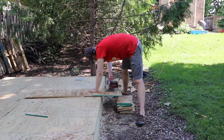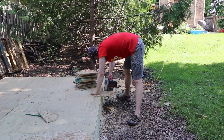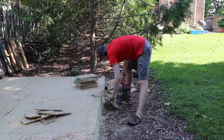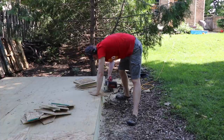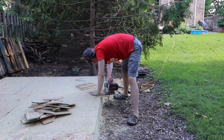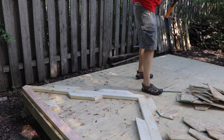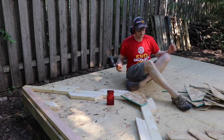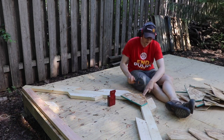The one thing that I did — and I don't believe I have footage of it — is that the very outermost rafter doesn't get gussets on both ends, because on the outside you're going to have the outer plywood sheathing or siding, OSB, or whatever you end up doing. I did sheathing. So you don't want these gussets, otherwise it'll bump it out an extra 7/16th of an inch. I also added another vertical 2x4 so that I could nail my sheathing into something in the center, as opposed to having this great big open triangle with really nothing to hold the plywood. Of course, you can add more beams for extra strength if you want, but this is, after all, a small shed — not a house.